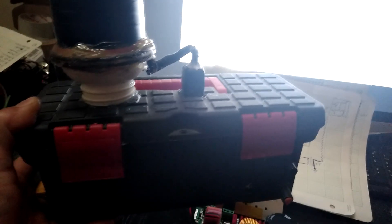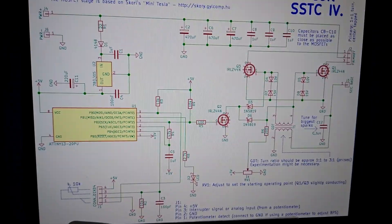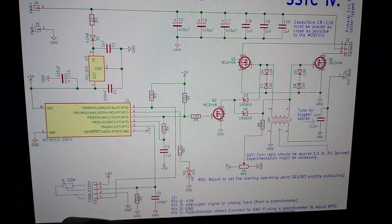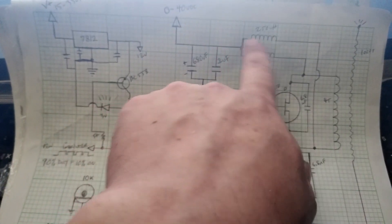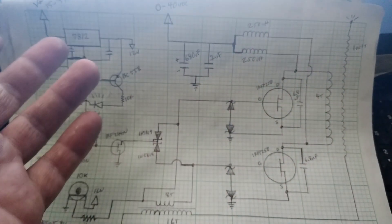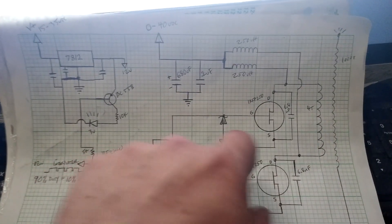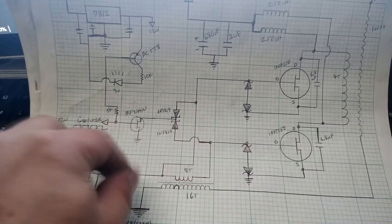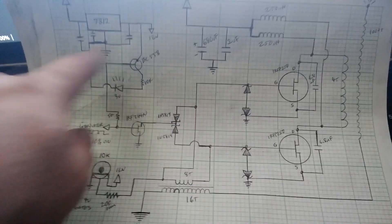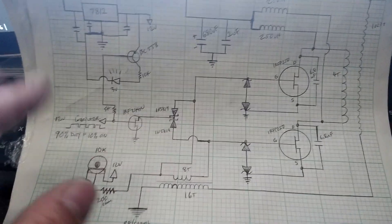To do that I had a gigantic heat sink in there. They're all based off this T-fetronics driver right here — it just ends up looking like this. It's the same circuit except a couple of chokes coming down, so you treat it like a Mazzilli driver where you have a center-tap primary, dual chokes, and just a single primary 12-volt regulator voltage divider on the gates referenced to that 12-volt output.